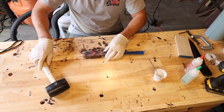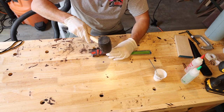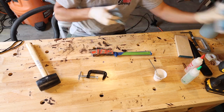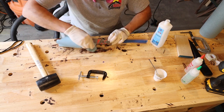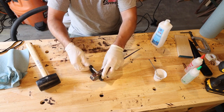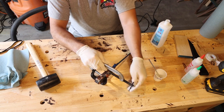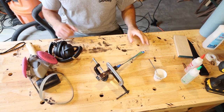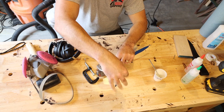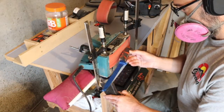Using my little rubber mallet, just giving it a few taps to make sure it's on there securely. I'm using that smaller pin just to get the pins in so they're even — so I don't have the pins sticking out more on one side than the other. Then I'm just using some nail polish remover to clean up the epoxy that has oozed out. I'm going to clamp that down nice and securely and leave it overnight, even though I have the same shirt on.